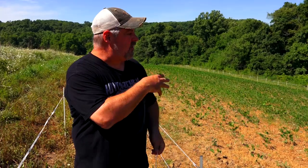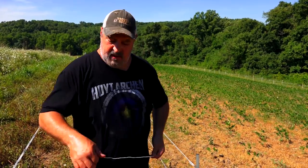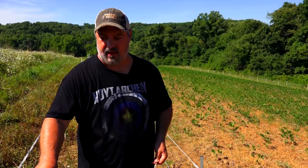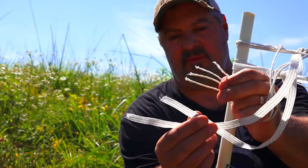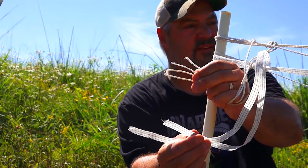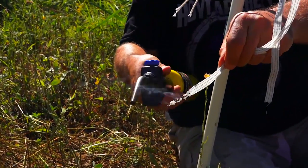We're back at the energizer now. We've got all three strands — our tape on the outside and our two wires on the inside — all run through all the loops in each pole. What we're gonna have at the end hooking up to the energizer, which is clearly labeled, is two strands of the thicker tape and four strands of wire where everything meets here.